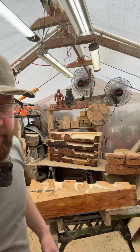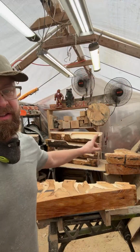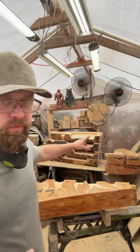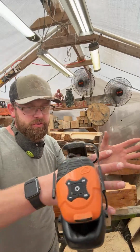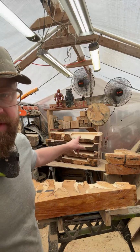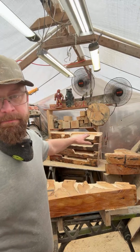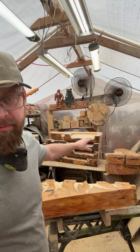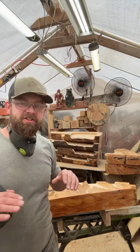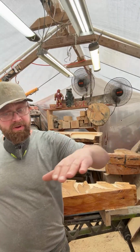We got 55 watching, so I'll explain what's going on. Great big camp on Lake Placid. They got a tree trunk in there from one floor to the next. These are the steps that spiral around that, about 5-inch thick yellow pine treads. We're carving them out. Me and the customer spent a day, and we drew a design pattern down the treads so everything flows. We're gonna put LEDs that wrap around the inside of each tread, river stones, some carved fish, some other items the customer has. And then we're gonna pour them with a nice clear epoxy, maybe a little color on the bottom and then some clear epoxy. And then we're going to build some dams and have it waterfall over. That way each stair tread cascades from one into the next, so when you're looking at these, it's going to look like a flowing stream all the way down the staircase.